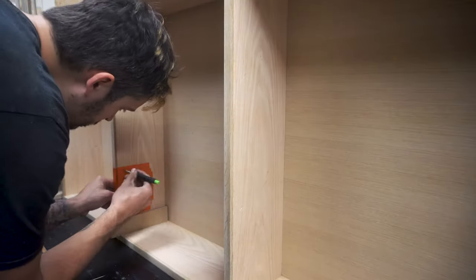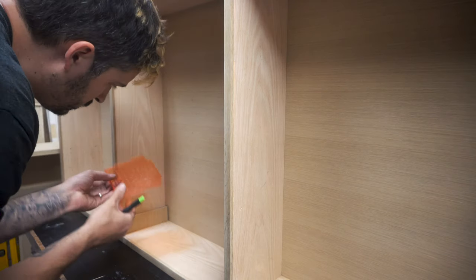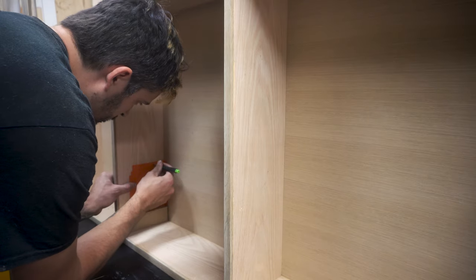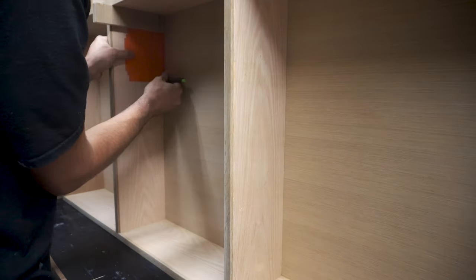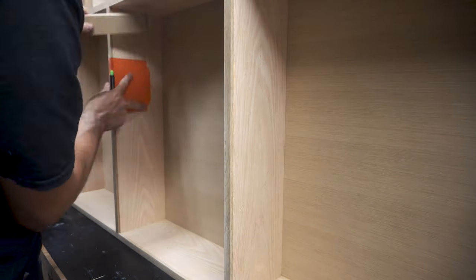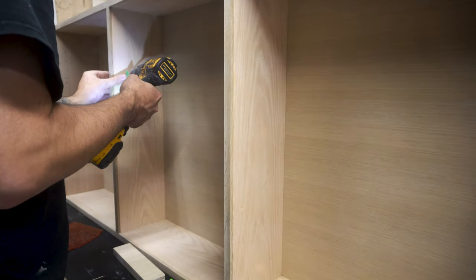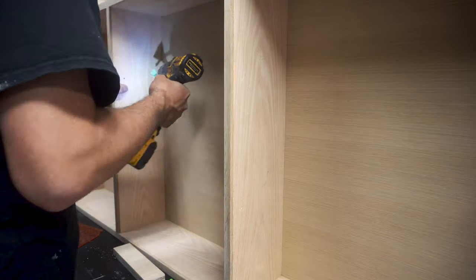While that silicone cures, I marked and drilled out for the shelf pins. Here I'm using a shelf pin marking jig, which I'll link in the description down below. I then bored out the holes that I marked using a 3/16 of an inch drill bit.